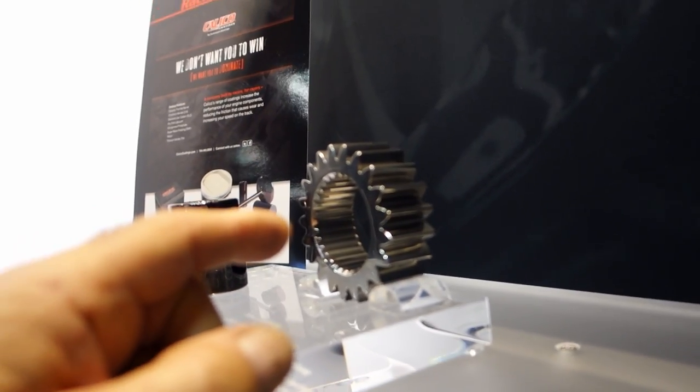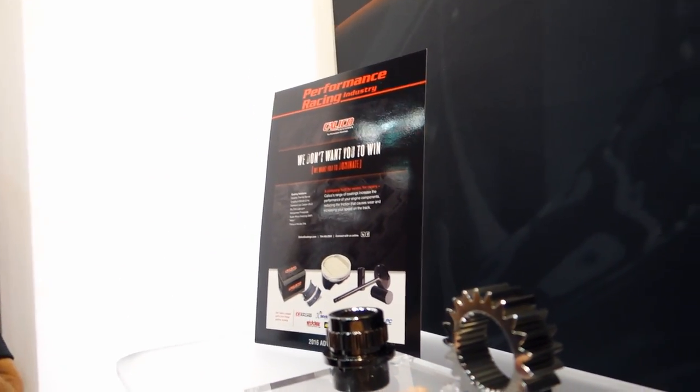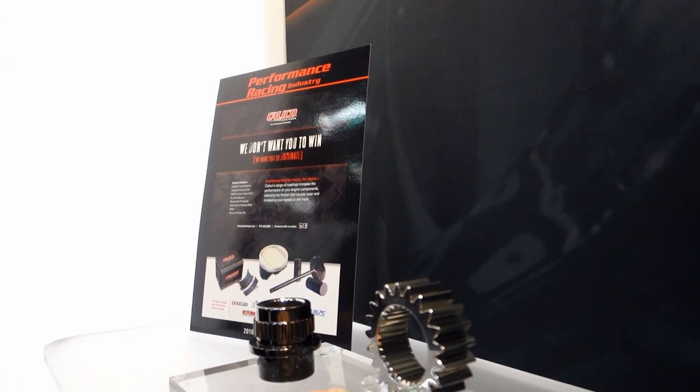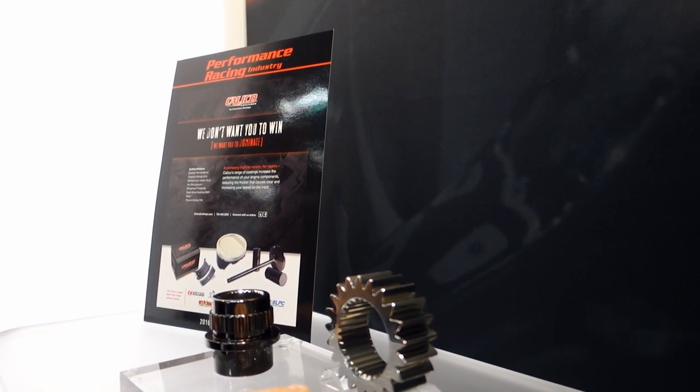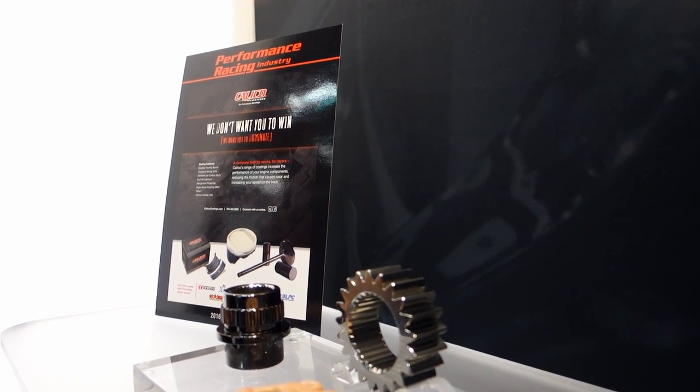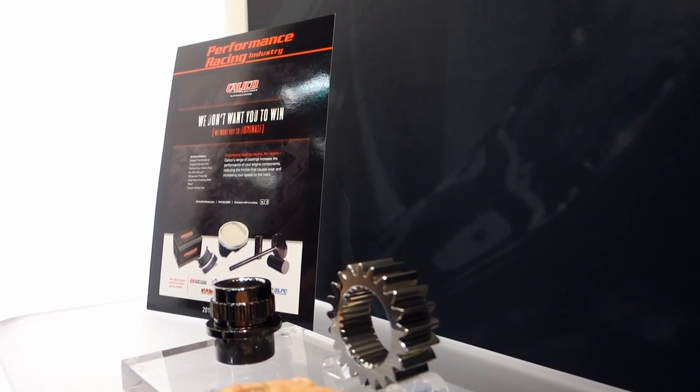The question I have for you is, how do you know when it's too much, that you've taken too much off the gear? Well, because we have a profilometer, we'll check the roughness coming in, and then when we're trying to determine the process on a new part, we'll shorten cycles until we get it to where we want it.